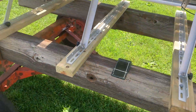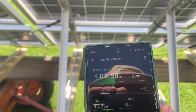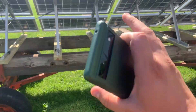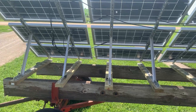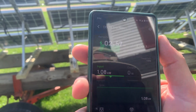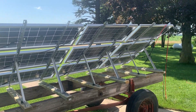We'll do one last check — we're pulling in still almost 1.1 kW now. We are in July so I should have these angled a little bit more for my zip code, but after July it goes back to roughly 30 to 35 degrees — mine are set at 35 currently. Peak for July I bet if I tilted these back more to the 22-degree range we'd get just a little bit more, maybe up to 1.2 today, but there is that little bit of fog in the atmosphere keeping me from full wattage.